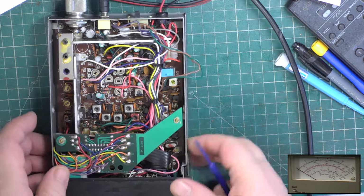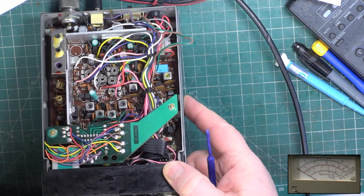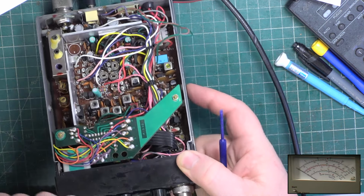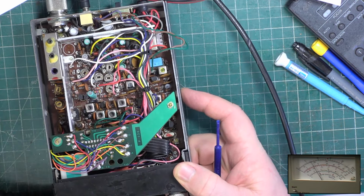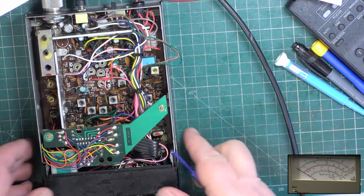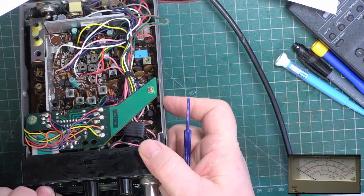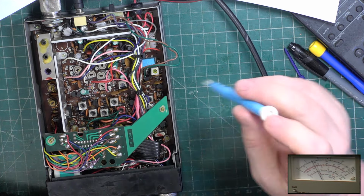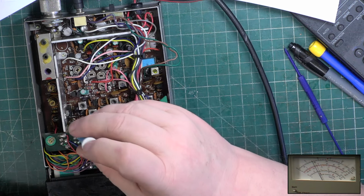Right, so let's have a look at the other channels. Channel 40, 3.5 watts. Channel 1, 4.1 watts. So let's balance that a bit. Let's go channel 40, because it hasn't worked out on its own, has it? So let's just see which one is affecting it.